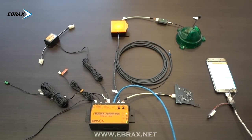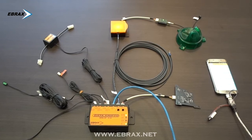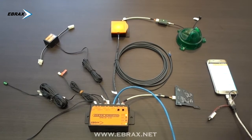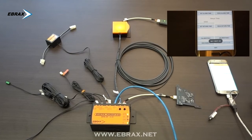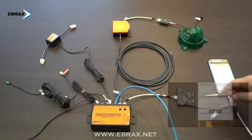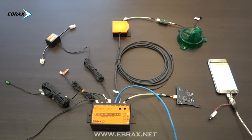We do not need the equipment to continue working, to keep on beeping or with the contact open once we have removed the thread. While we are connected through a wire to our equipment, we can calibrate sensor number 1 with antenna number 1 and calibrate sensor 2 with antenna number 2, that is the one that is introduced inside the card reader to detect deep insert skimmer attacks.